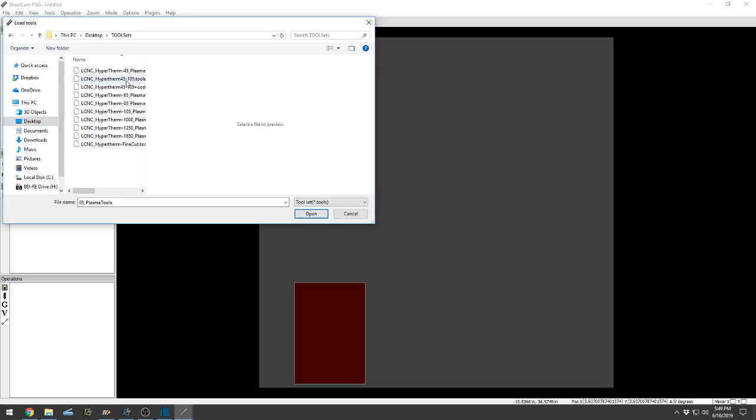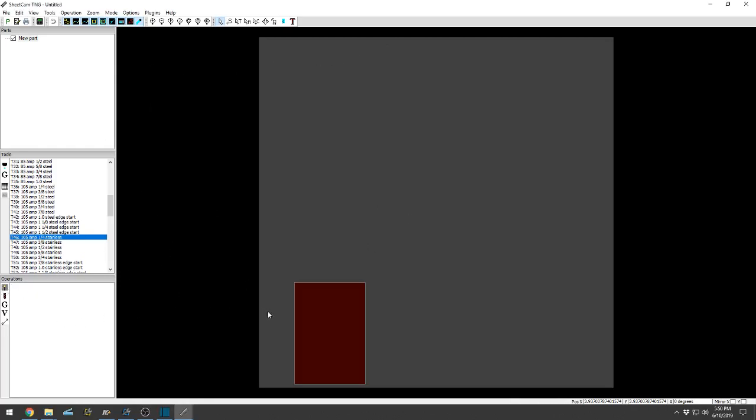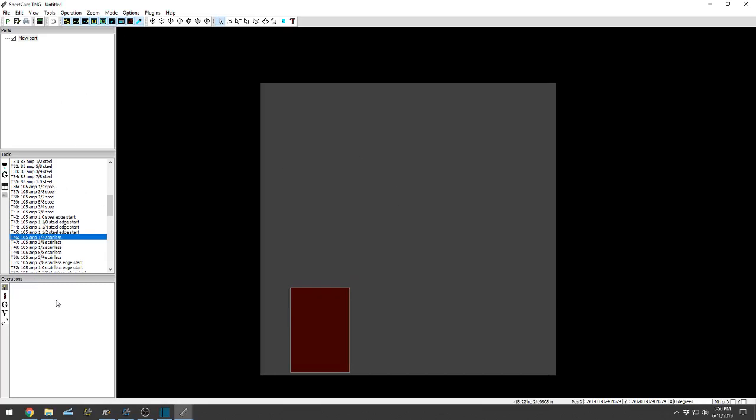From here you pick 45 to 105 tools. If you ordered a table through Boss Tables, this will already come preloaded — you won't have anything to worry about. Here they are labeled 45 amp, 65 amp. This is a really good gauge of what thickness you can readily cut: with a 45 amp, half-inch and quarter-inch aluminum; 45 amp quarter-inch steel. It's fairly self-explanatory. You can click here to review the operation if you like, but you can make changes as you get more comfortable. Change your height delay — I generally leave all of this alone. If I feel like I need to make an adjustment, I do not save it that way; I always have the skeleton of what I know works. Now I have my tools. I need to put some parts in there and get some operations.